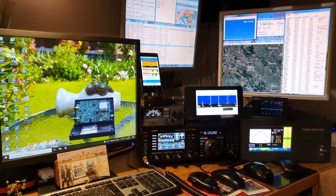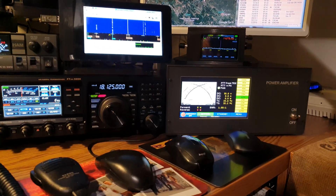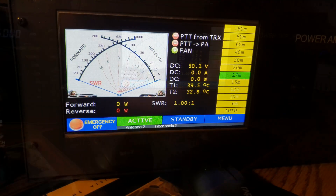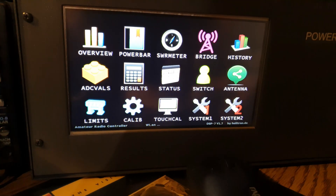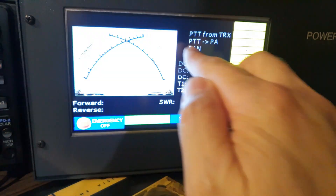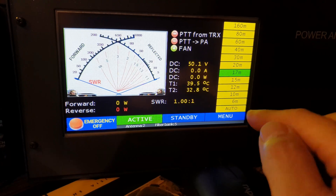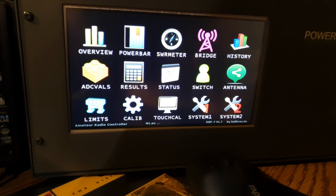Hello my friend, I'm done with my shortwave amplifier. The most interesting thing in this solution is that settings can be made on a 7-inch touchscreen. On this screen you can see a lot of useful information during operation, such as output power, temperature, SWR, and so on. The power amplifier includes 2 MRF300 LDMOS FETs and several built-in sensors, as well as an automatic protection function. Let's see it in operation, and then some photos of how it was made and what it looks like inside.